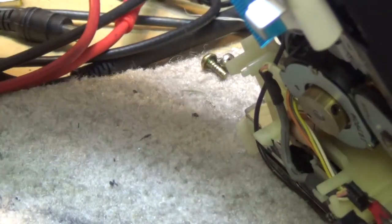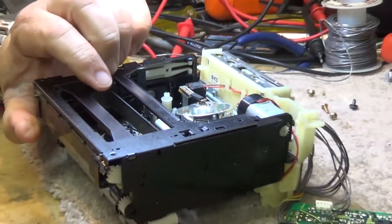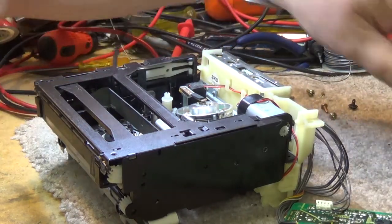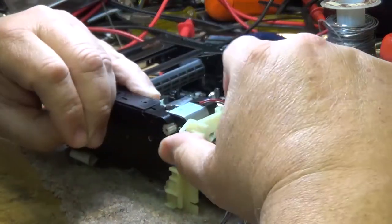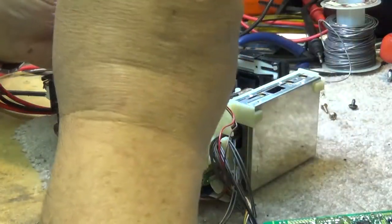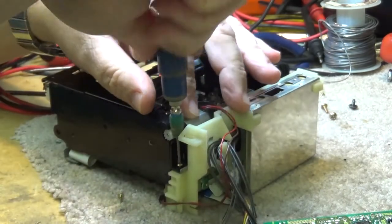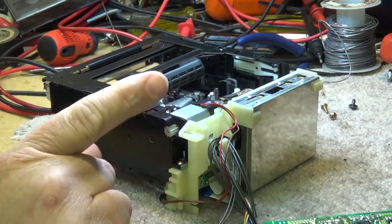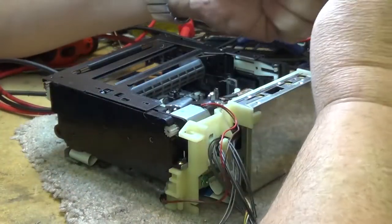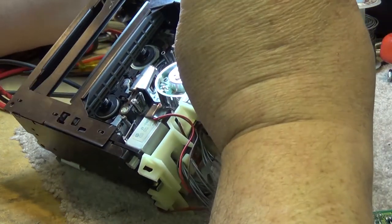The solvent-based head cleaners that work fine for other types of tape machines, I would never recommend a wet cleaner for any VCR. Just because you put a wet tape up against a spinning head, you're asking for trouble. I would never use an Allsop or any other type of head cleaner, but where those wet cleaners worked was in the original cassettes. They had a little mechanical cassette with a little wiper arm on it. You put the cleaning fluid on it, and the little wiper arm would go back and forth on the cassette head. They were somewhat effective, although I still say a gimmick, but hey, Allsop Corporation sold millions of those things to people.